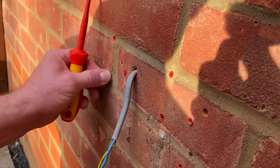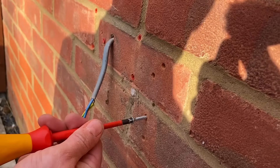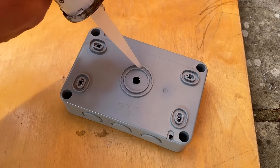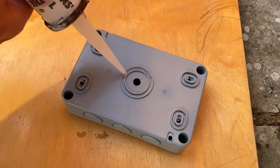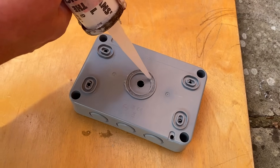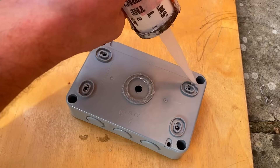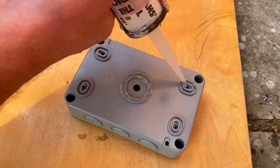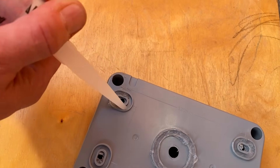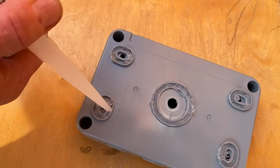With my fourth hole drilled I put my red plugs in all positions. I then use a screw to tap the old plugs through into the wall so I can seal them up later, and hopefully that brick dust will save the day. I apply silicon sealant — check the manufacturer's instructions for the one you're using — around the cable entry hole, slightly overfilling it. I do exactly the same in all four screw positions. Once the silicon is on, you're up against time, so don't position it incorrectly and alter the silicon — getting it back in the right position is crucial.